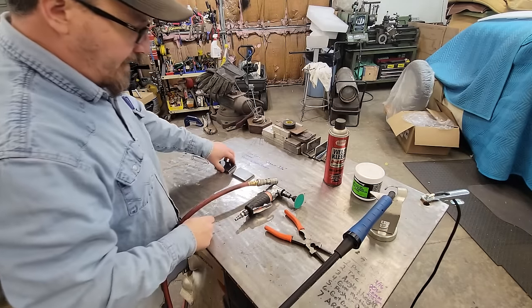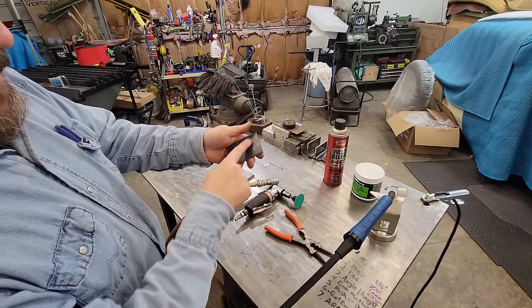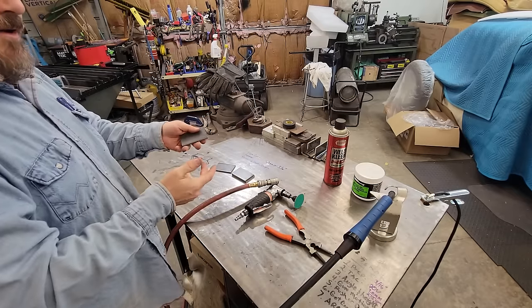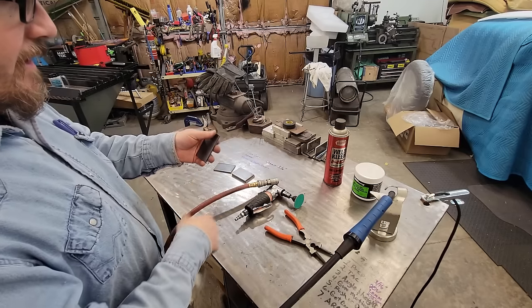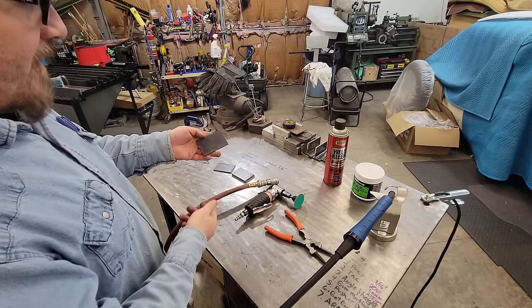All right, guys, you're going to want to get this mill scale stuff off here, and you'll see how dingy it is. You can buy this stuff, hot rolled P&O. It's called pickled and oiled. It doesn't have a mill scale on it. It's good and clean. That's what we use for plasma cutting stuff. Works really good. But this is just some hot rolled I had around here.